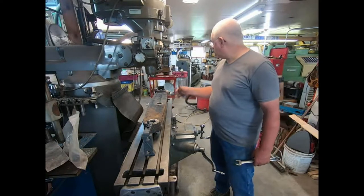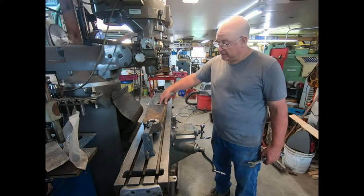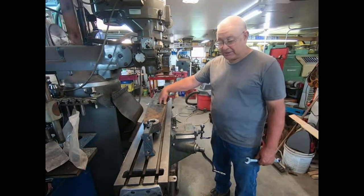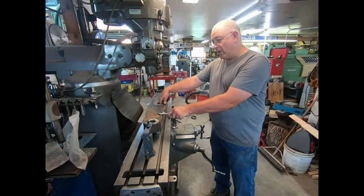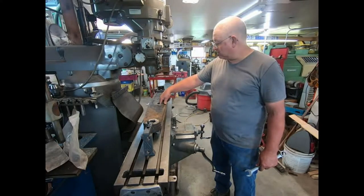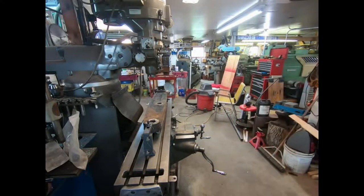And then we'll go to start cutting the bushings. For me, it's a lot easier. I've done a lot of engine building, a lot of boring with boring bars, but I always like to turn the outside dimensions to finish, to fit a bore. To me, that's easier than making a bore fit the outside, because I'd like to have a half thousandth or a thousandth press fit. So anyway, be with you in a few when I get that hooked up here, ready to bore.